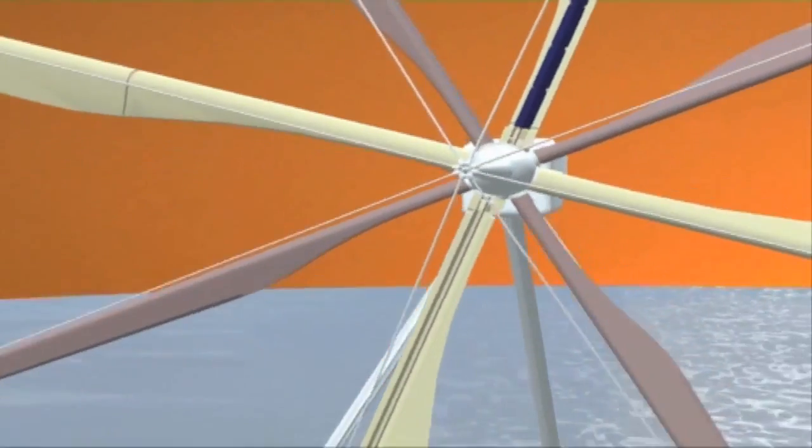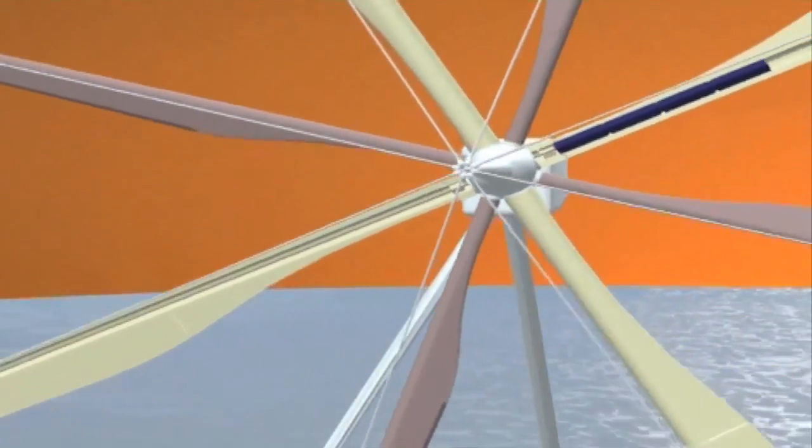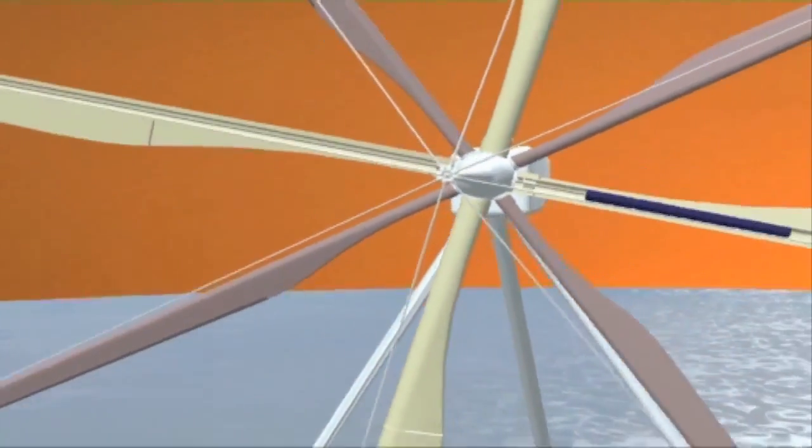This little piece that I'm going to pop inside the capsule is a key element in that story. My overall concept is that instead of connecting the turbine of a wind turbine directly to a generator or through a gearbox, you in fact convert the power inside the rotor. The rotor itself, as blades rise up, has masses inside that move along the blade.